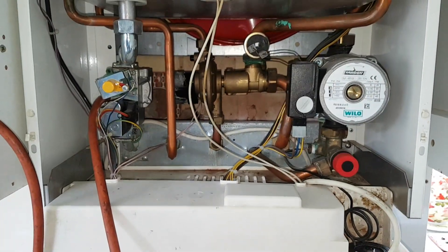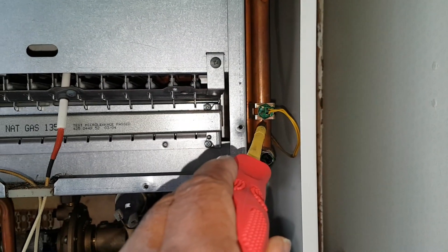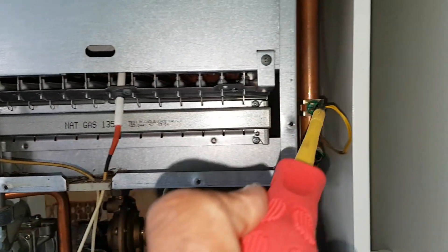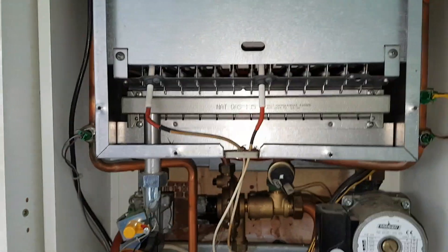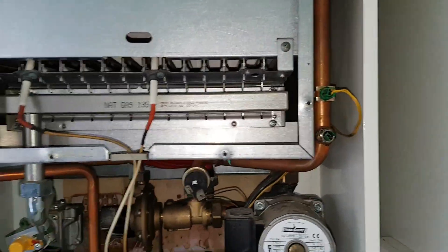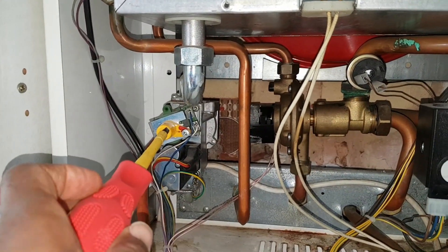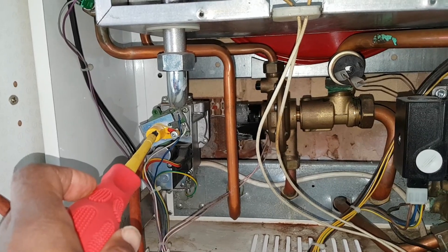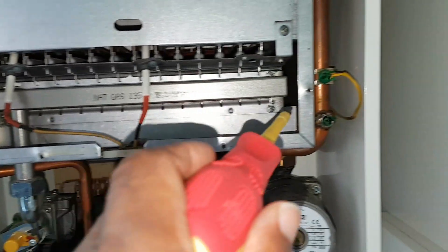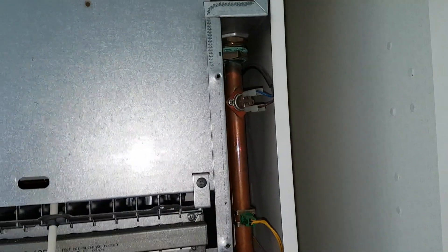Around the boiler you've got the primary sensor for the central heating here. Incidentally, on the hot water you've got both sensors — so you've got the hot water sensor and the primary sensor working together in tandem. On the heating it's just the one sensor, the primary sensor, controlling the heating. That modulates the gas valve, so the signal to the gas valve is increased or reduced depending upon the heat which is detected by the thermistors. And here is the overheat thermostat — if it gets too hot, that'll shut it down.